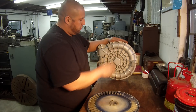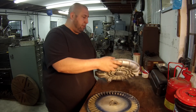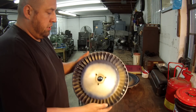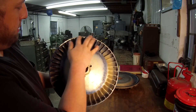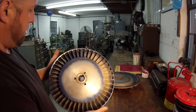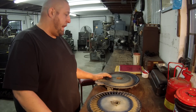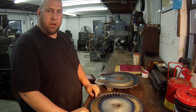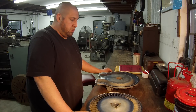If that doesn't work, I'm going to have to resort to another approach — possibly making a ring that'll bolt here that I can chuck on to hold it. That would actually be a better solution; it'd make it a little more rigid. But I'm going to try that center boss first. Here's a little better shot of the impeller — you can see out here where it's missing the bluing where it was rubbing, and it's machined on both sides. I'm going to set this up — this one's the easy part, so I'm doing it first, then move on to the housing.